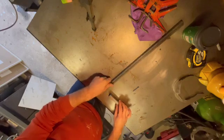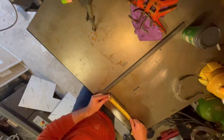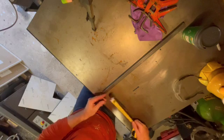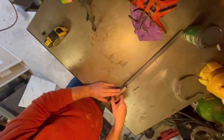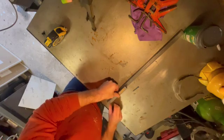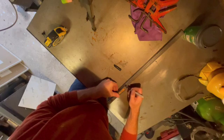We're going to move on to making a little platform that will come off the rear of the rectangular base between the rear axle at the back, that will just hold the pure argon bottle on the back. So I'm just going to go ahead and cut some more steel, more box section of the same size. So just need 3 pieces here to make that small platform come off the back. I'm just measuring them all up the same size and measuring the argon bottle as well. So always have the same size argon bottle, so no need for too much overkill on the size of the base for the bottle.